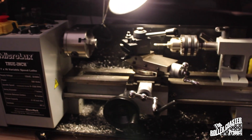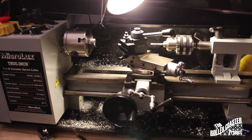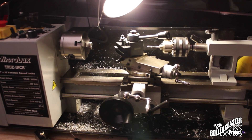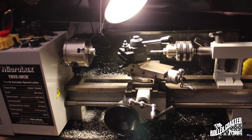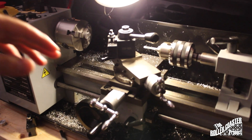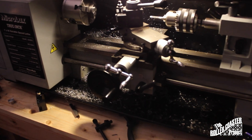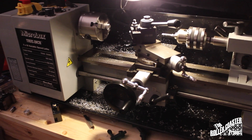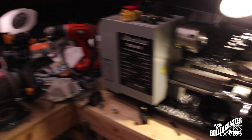I like having a manual lathe, but it's not very accurate. I'm thinking about converting it to CNC — I'm not going to use the lead screw anymore. I'm going to put in two ball screws, one for the Z-axis and one for the X. From the different things I've seen, I'm going to probably mount the motor on the other side, though I'm not sure if that's a good option. I was going to use that to get some repeatability in the parts, but I'm not too sure at the moment.